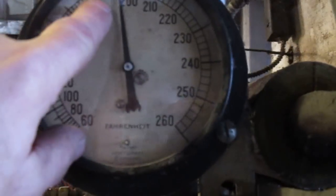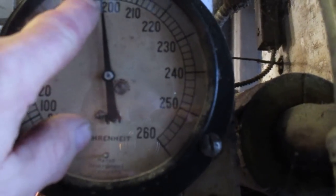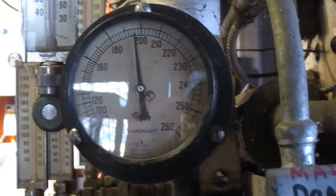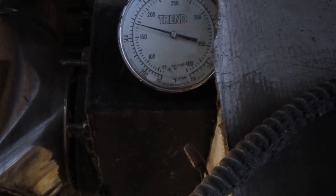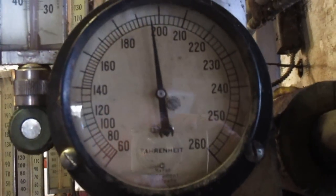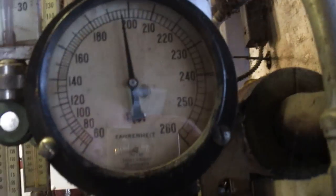This light that turns on in the back — I watched this run at the same temperature for a couple years, and having that gauge made it a lot easier to keep control of everything. The water temperature is now 196. It's still throwing 340 degrees up the stack — that's why it's still heating. That's why I clean the tubes before a cold spell, because that keeps the temperatures high and you're not wasting heat.